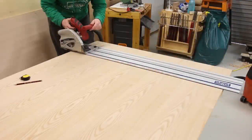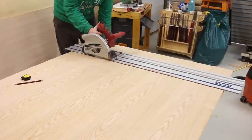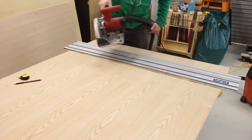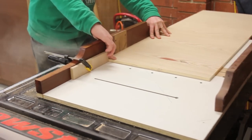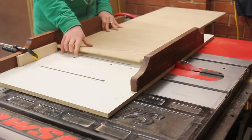The drawers were made out of 12mm poplar plywood, which involved a lot of batching out. First I set the crosscut sled to width and to length, then used the dado stack to cut pretty much all of the joinery — first the dado for the plywood bottom, and then the locking rabbet and tenon on all the side pieces.